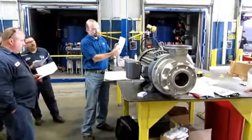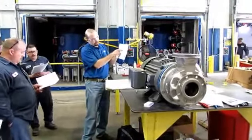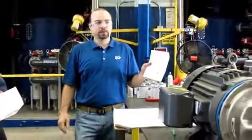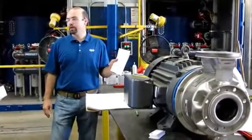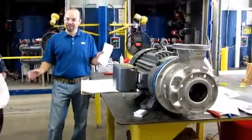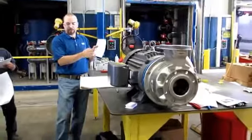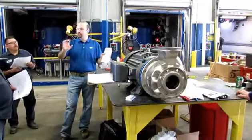You've got that motor adapter. The seal chamber fits onto the motor adapter. What does the seal chamber do for us? It holds the seal — the non-rotating, stationary half. If it's holding the rotating one, we're in deep trouble. So the seal chamber is simply a separate piece so we can have a high precision tolerance fit for that stationary seal.